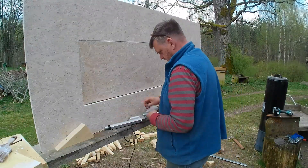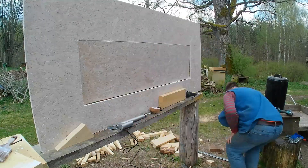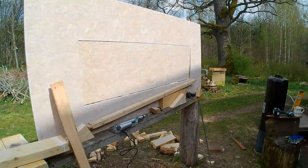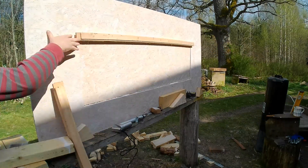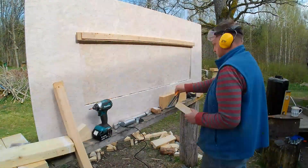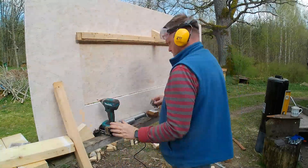I've got this window on a jig and I bring out the actuator to play about with placement. I've changed my mind on the design — on the original design you saw the actuator at the bottom, but I've realised that if I fit it at the top I will get a much greater angle of opening. But I've got to make the board rigid to take the strain. These actuators are rated to 750 Newtons, which is about 76 kilos, way in excess of the load of this window which probably weighs five kilos at most.